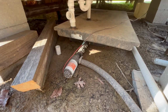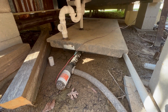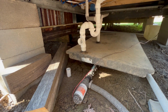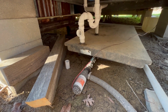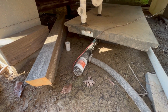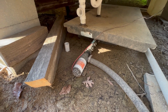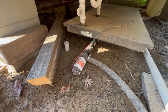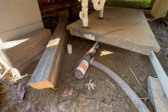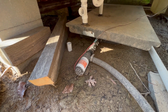If we lived here, it would definitely become a problem. But if we're going to be here one night a week at the most, I don't think it's going to be a smell problem. It's going to biodegrade all by itself. But if it becomes a problem, we'll put it in a septic tank. The macerator pump, because it chops it up so fine, will make it decompose quicker. There's more of the biodegradable molecules exposed to air, bacteria, et cetera, so it's going to degrade faster.